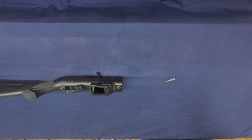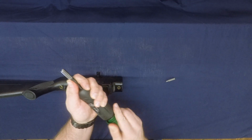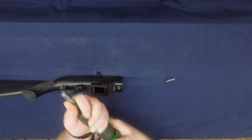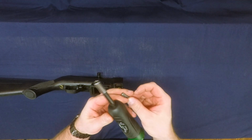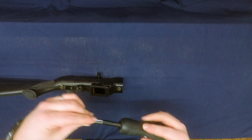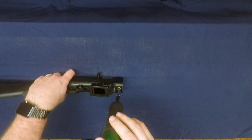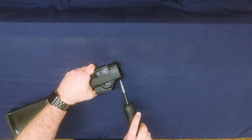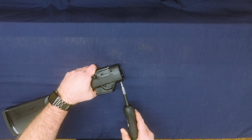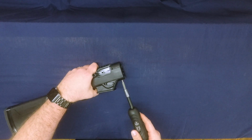This is a pretty neat torque wrench. So again, I can set this to 65 inch pounds. I'm going to back that down. So once you get your wrench properly set to 65 inch pounds, again, this is inch pounds, guys, not foot pounds. So if you're using the wrench from your car, those are set up for foot pounds. This is 65 inch pounds. So I'm going to go ahead and tighten that. We hear a click. So now we know that that's properly tightened.